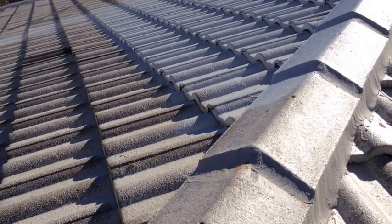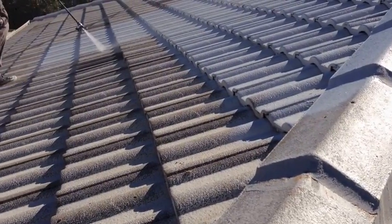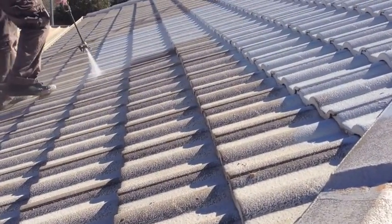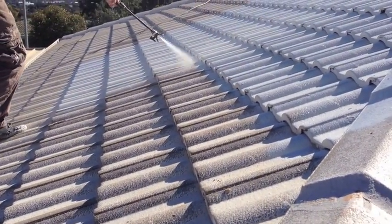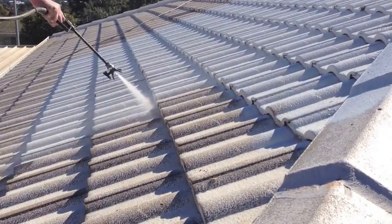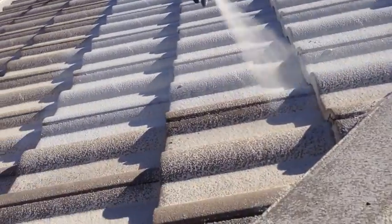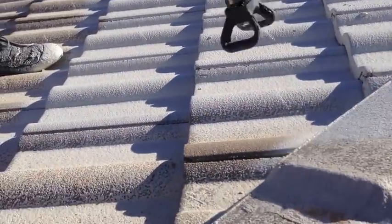As shown here, this is the first of the top membranes. In this case, the customer has chosen white for its high reflective qualities. It is of utmost importance to apply the coat with the correct amount of overlap using an even stroke and a coverage of about 160 to 180 microns.